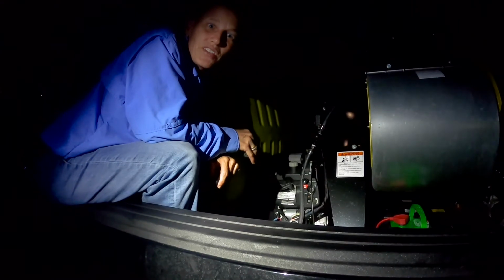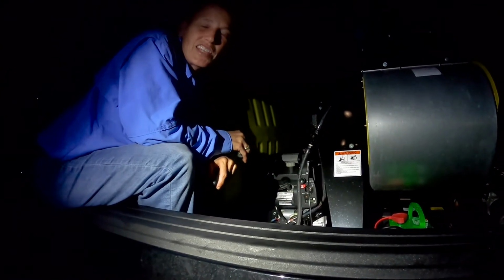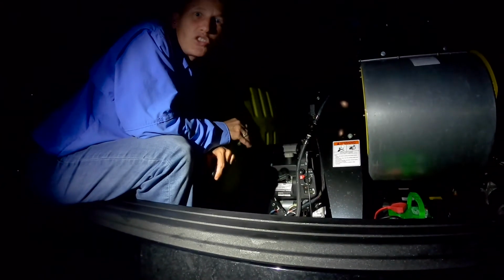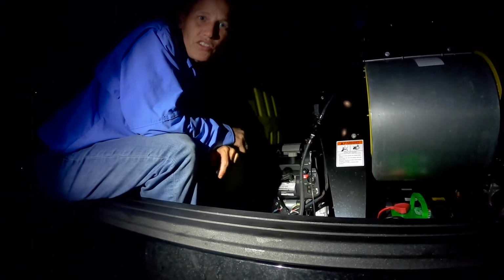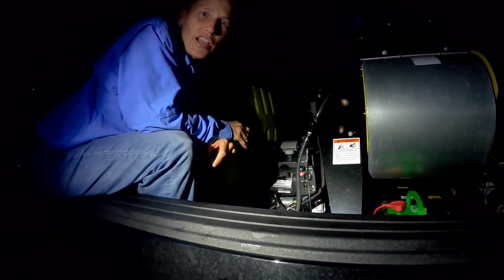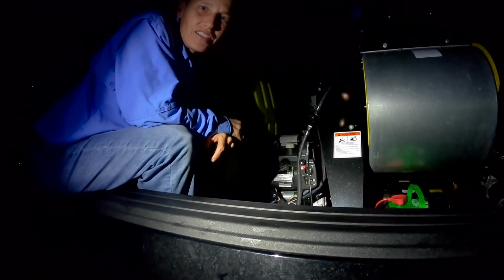It's important to conduct characterization runs using the same parameters as you would for normal operations. For us, that's 10 miles an hour with the boom pointing straight up. We're stationed about 200 feet from the card line. There's a cone placed here and another cone placed 200 feet past the card line. We're going to turn the equipment on, drive 10 miles an hour, and drive in between stations 0 and 30, perpendicular to the card line. Everything's set, so let's get started.